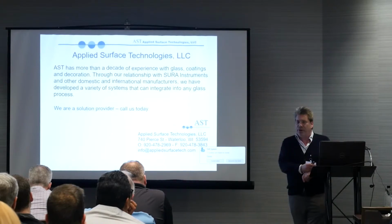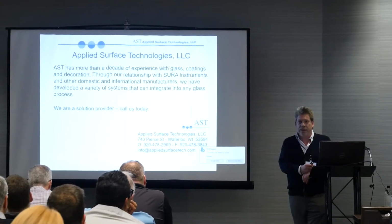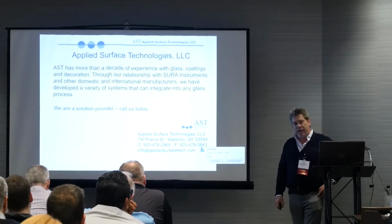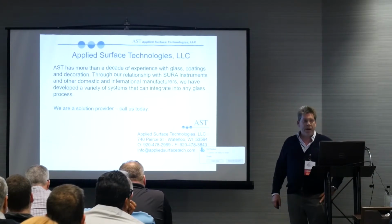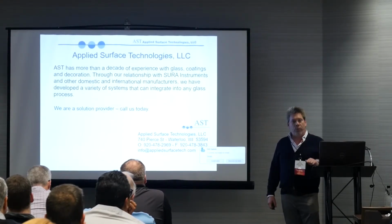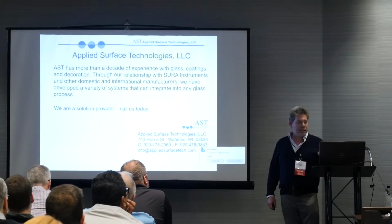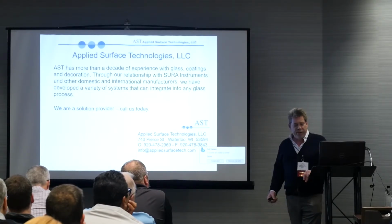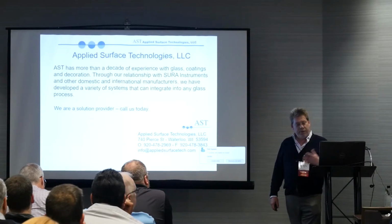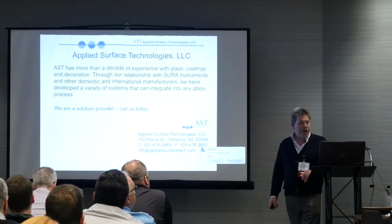I did hear a question earlier about whether the Pyrosil was a messy product. Somebody asked that. There is SiO2 that is output during the process. You shouldn't see any of it on the glass. This is applied at such a small rate that you should never see it on the glass. There is a buildup near the burners of this SiO2, which is really sand, it's silica. It's very lightweight. We have blowers that pull it out, but there is some accumulation. You just take a brush and brush it off the burners and sweep it up. So it's not a very messy process at all.